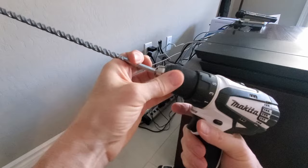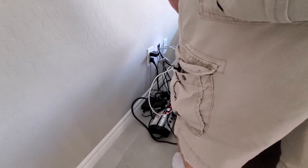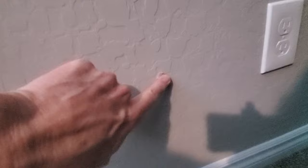You'll need a drill bit for your cordless screwdriver — use the largest bit you have. The drill bit I'm using is made to go through thick walls, however you can use a smaller drill bit. Just make sure it's long enough to go through to the other side. Here will be the location of our new wall jack, and now I'm going to use a drywall saw to enlarge the hole. I want the hole big enough to fit the back of the wall plate.